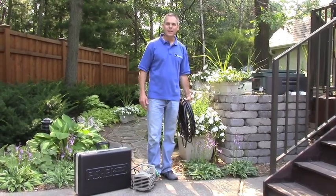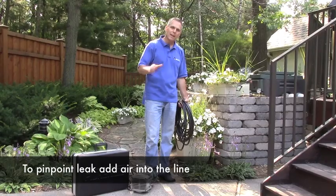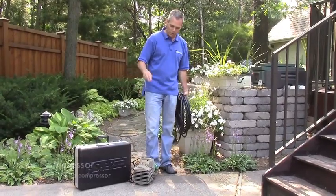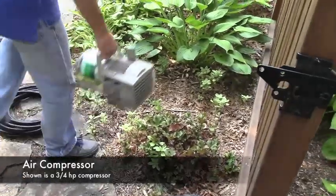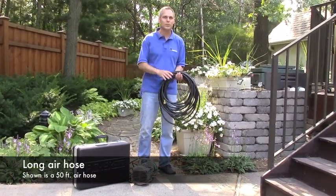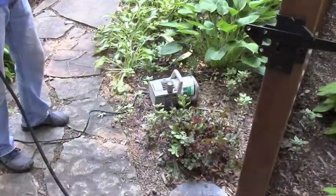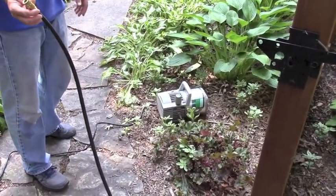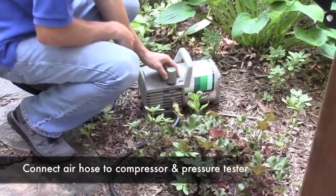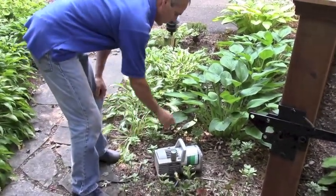So we know there's a leak in this return line. Now in order to pinpoint where that leak is, we're going to get to the second part of the pressure testing process. To pinpoint this leak, we need to add air pressure to that leaking section of plumbing so we can make a bubbling gurgling sound underground. In order to do so, we're going to need an air source — I just have a simple three-quarter horsepower compressor here. I need a fairly long air hose so we can get the compressor a long way away from where we're listening, so the sound of the compressor doesn't confuse us when we're listening to the leak sound. We also need some sort of a listening device. We've already got the airline hooked up to the pressure tester back where we're going to induce pressure at the equipment. I'm going to set the pressure regulator to maintain no higher than 10 psi of pressure, and then we'll turn the compressor on.